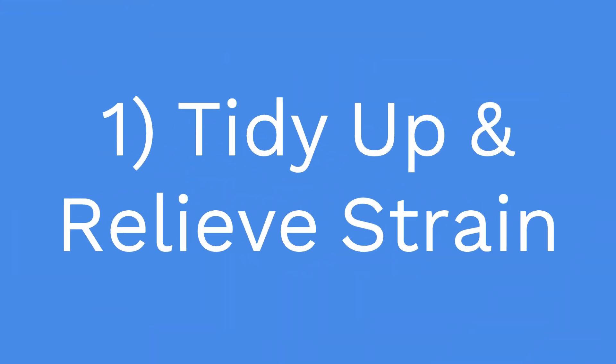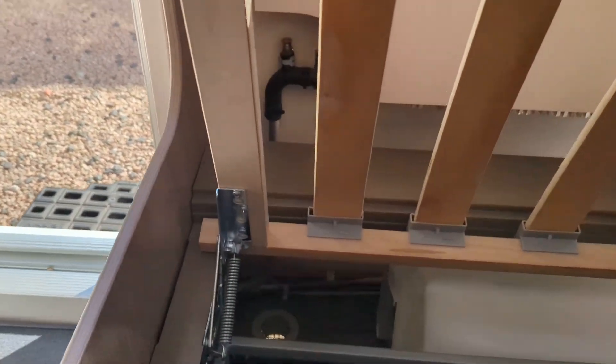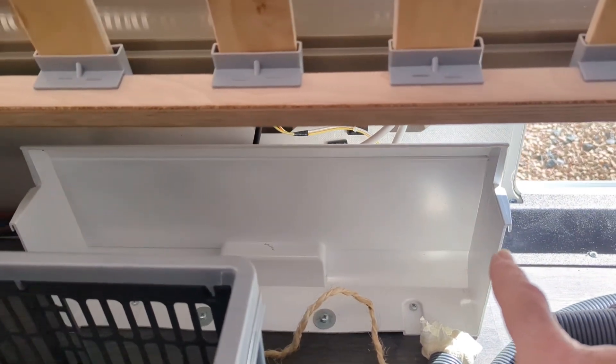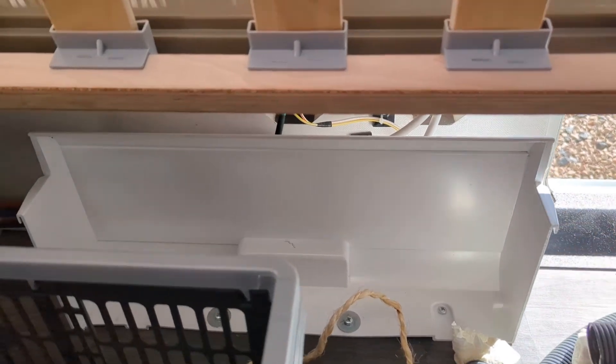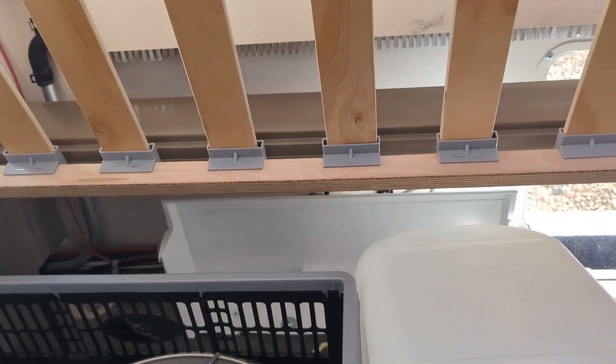So let me show you what I did. First of all I tied it all up with tie wraps and then installed protection. Under this under-seat locker there are connectors — outside connectors, a mains connector — and all that cabling is vulnerable to things being thrown about in the caravan when you're travelling. So I put in baffles. This is the front of an old drawer from a freezer cabinet, which I bolted to the floor, and now it's protecting against things bouncing around as you're travelling.